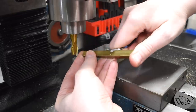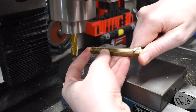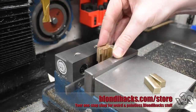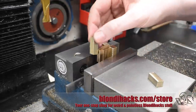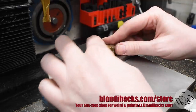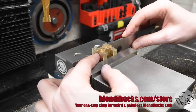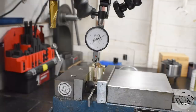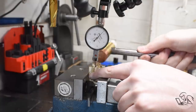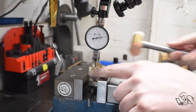Here you can see how those packing blocks work. They aren't machined on the ends because the ends don't matter, but because they were all machined together, all four sides are identical - especially if I keep them in the same orientation. I can use those to hold the legs of the crosshead and machine the posterior. For this I need it very vertical, so I squared it up roughly with a parallel and then I'm indicating it in to make sure it's good and straight. There's also a parallel under it just to keep it from sliding down in the vise, since that's a cast surface, not a reference.